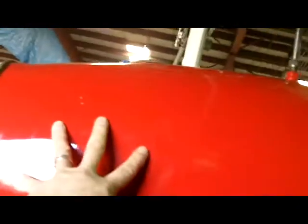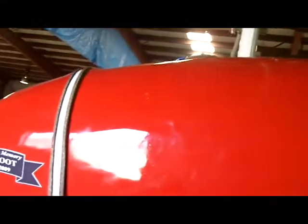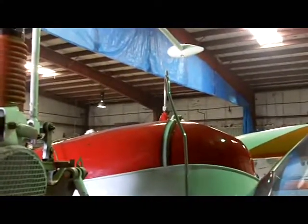Continuing at the engine, we're going to start up here with the fuel tank. I like to do all the fluids and dirty work at the same time, so we'll do all the fluids at the end. Check the tank for damage, make sure there are no leaks, give it a push to make sure it's secure. Check the vent line coming up here — it comes up, then goes back down to a tee, and then up to the other tank.